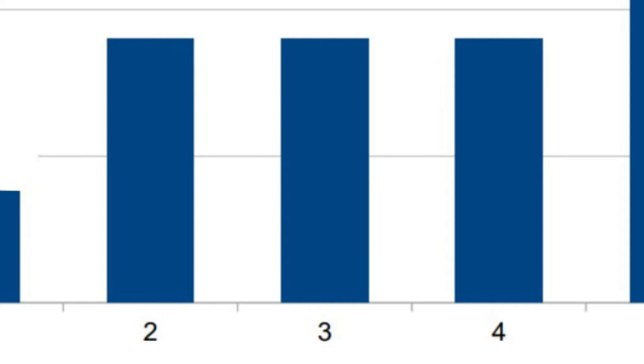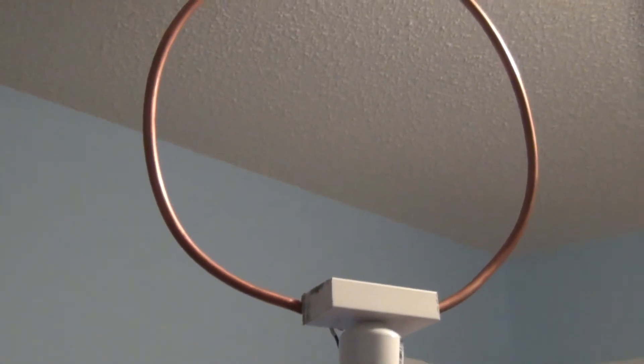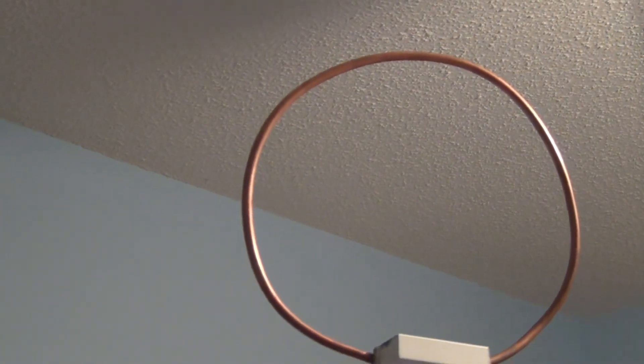It's interesting that the 12-gauge copper wire also scored 119. The 10-gauge copper wire was the overall winner with a score of 131. I was surprised it tested slightly better than the quarter-inch copper tube. To be certain, I cleaned up and reattached the tube and tested it again with the exact same results. The tubing tested slightly less efficient at 130, or 99% of the best.